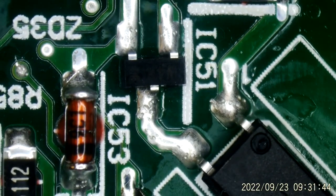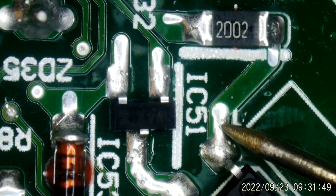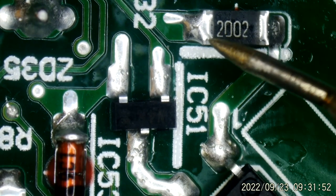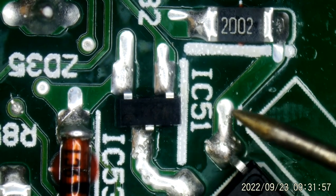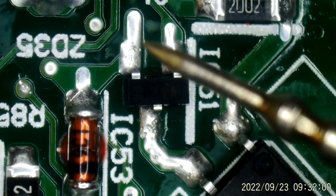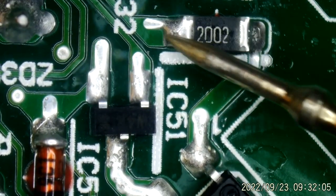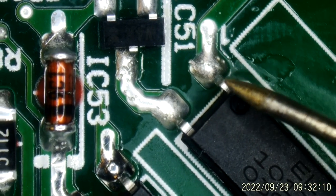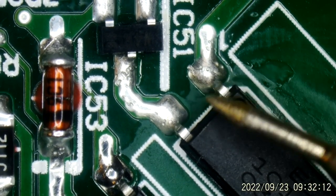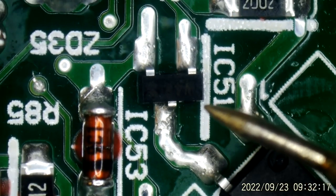And following this back here, I believe this side is controlled. It has a supply voltage on it, which is like 16.5 volts, the same supply voltage that drives the DAP53. It's a supply on the hot side of this supply, 16.5, 17 volts, something like that. And that's what's coming through this resistor into pin 1, which is the anode of this opto-isolator. Now, to turn this on, this side has to be pulled down to ground. What does that? Well, we have a MOSFET here.